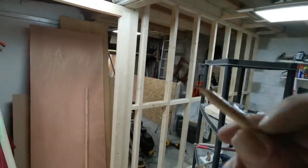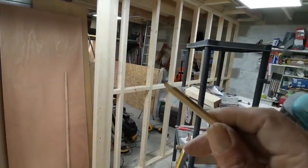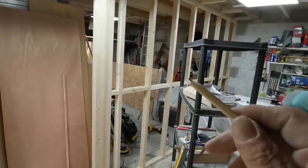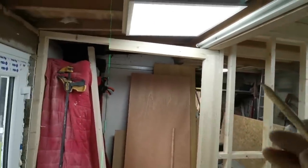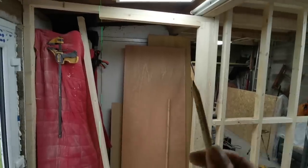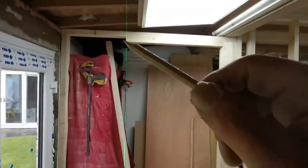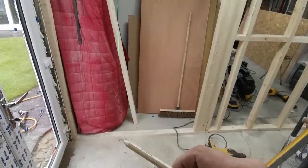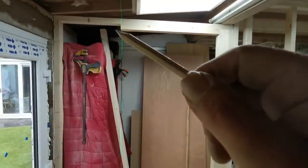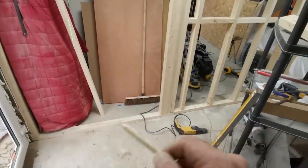It's a bit difficult to show on this, but if this was a regular wall I'd put two studs that were the door width or door frame width plus two timbers — so the door frame plus two. What I've got here is the head and the frame will just fit in there with about 10-15mm clearance so I can plumb it. What I want to do is put a timber down there that goes to the floor, and another one behind it that will sit on this timber. Normally I'd put that first timber in, then a timber, then cut the bottom out of the sole plate.